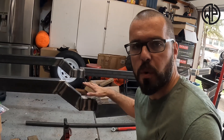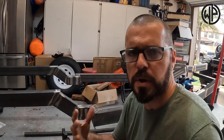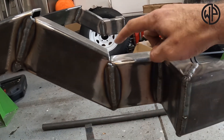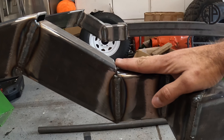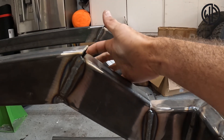This rear section is something I didn't show on camera — because once you understand how you're taking measurements in the front and applying them to the back, it's basically the same thing. You'll notice the angles here don't match anymore because this was straight tube and I cut the angle on one side, so I'm going to have to gusset these — which isn't a bad idea since this is before the rear axle and could be a weak point. I'm also going to fish plate everything on the outside as well as on the inside. I made the front of the frame a little long so I can cut it to the right length once I have the grill, motor, and room for a winch. The back I made much longer because I'm stretching the tub in two places for a total of about seven inches.